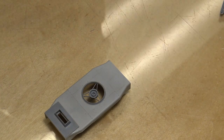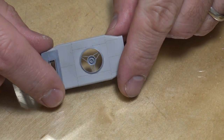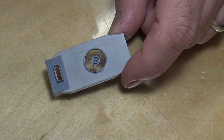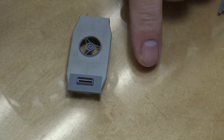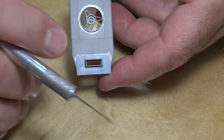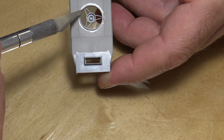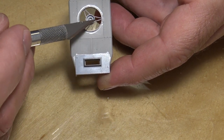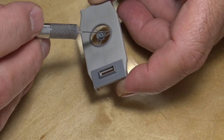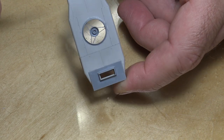So that's true, but there are three motor supports. So which one do you think should point to the left? There's a key to know which one is pointing to the left. So here we got the left right over here. You see these little bolt heads around the perimeter of the base? These are the motor mounts right here, pair of motor mounts. The motor mounts that go exactly between the two bolt heads are the ones that go to the left. So that's how you know.